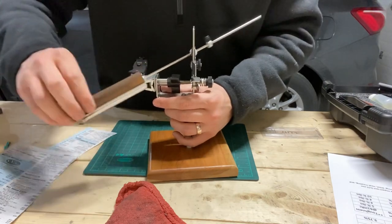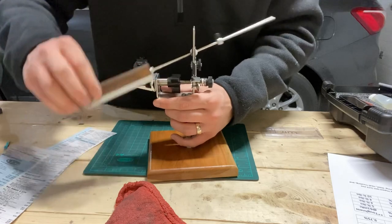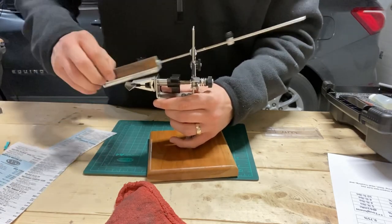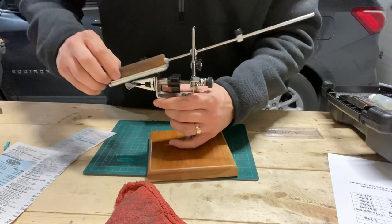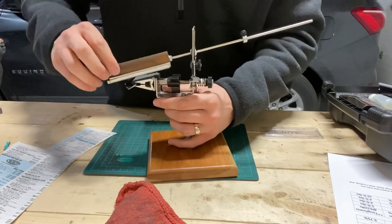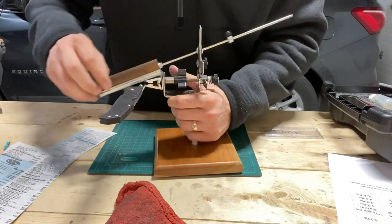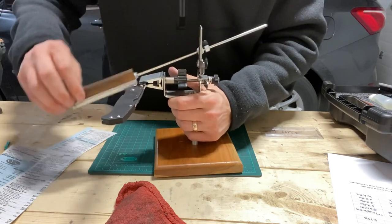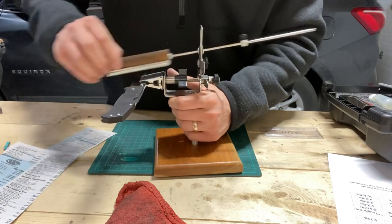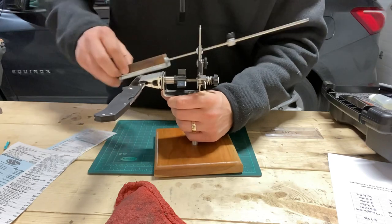Yeah, this is the Ken Schwartz CBN emulsions that they sell on the website. I've got 4 micron. This is part of why I believe that 1500 grit is 10 micron. Part of it is the actual finish that I see off of it. And the other part is generally you do those kind of 2x jumps, you know? So going from a 10 micron to a 4 micron, which is kind of their recommended practice. Kind of makes sense in my mind.